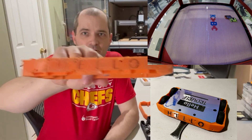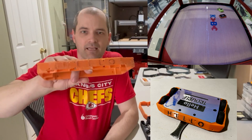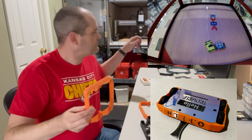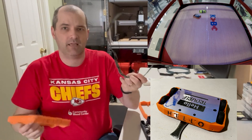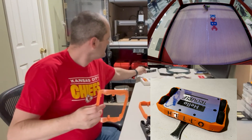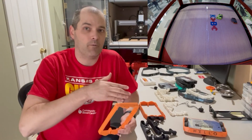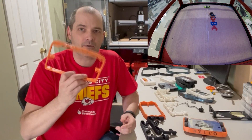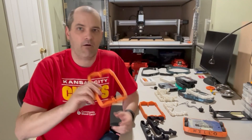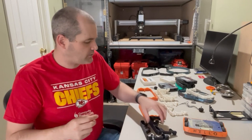One of the big changes I made was going to a double bushing configuration. With TPU armor, you can see how it gets chewed up by the end of an event, but it's still completely functional — and it worked a lot better and was lighter than spring steel. The benefit of having multiple robots is you can take lessons learned from one and apply it to the other, so TPU armor is what I applied to Hello Trouble first, and now all my robots have it.